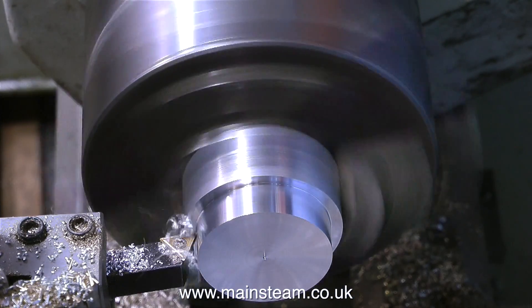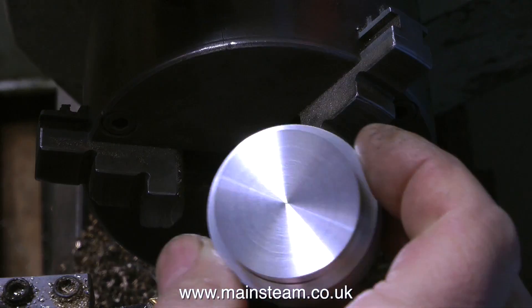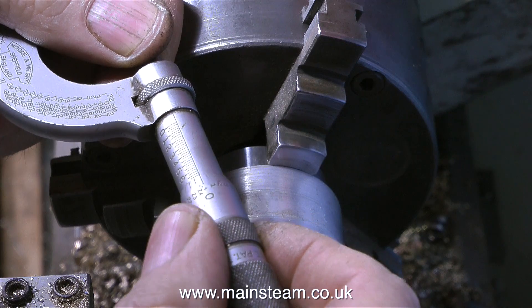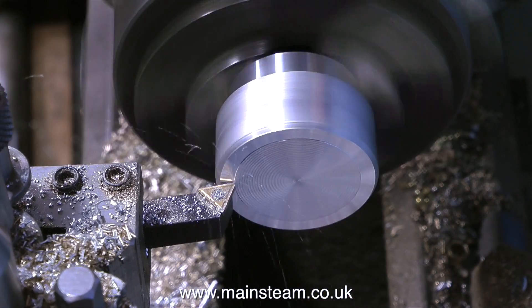Time to sit back and watch me make an aluminium pulley. This is the smallest piece of aluminium I had in the workshop — it's a little bit big and I'm having to turn quite a lot of it down. The finished diameter of the pulley where the drive belt fits needs to be three-quarters of an inch in diameter, so I'm setting that on the micrometer to get some idea of how much metal I need to remove.